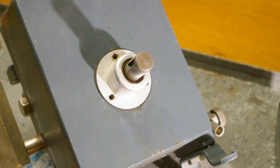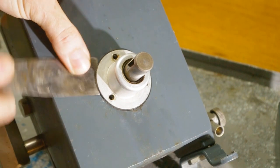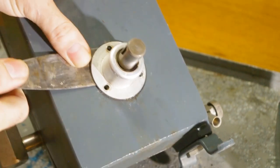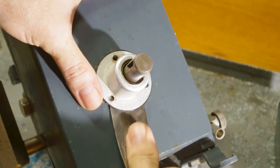Next, I go after the shaft seal. This was the second most difficult part. It's basically cemented to the pump housing, and I eventually figured this out after trying just about every tool on my bench. By the time I got it loose, I hit my memory card's capacity and the camera stopped. But the putty knife was what worked.